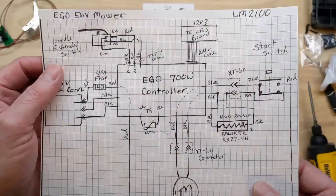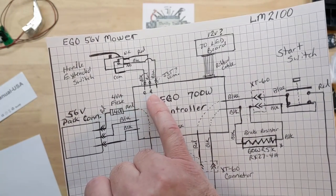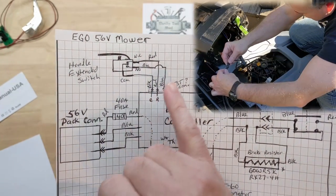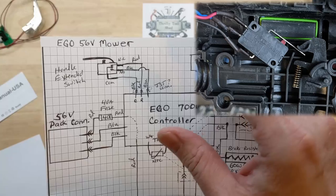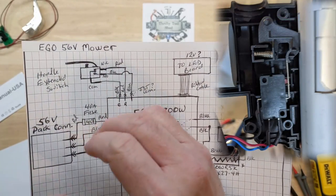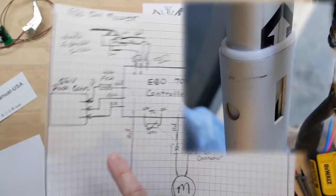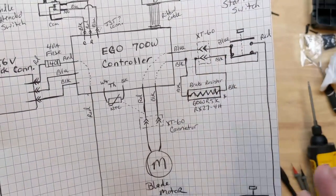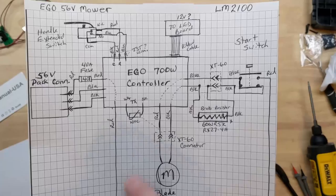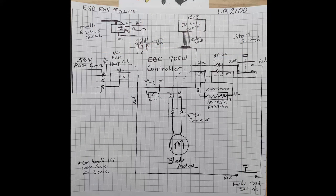When the button is released, the black goes across this 60-watt 0.5-ohm braking resistor — and notably these resistors can handle up to 10 times their rated power for five seconds — so when you release it, the motor energy is quenched across this resistor, which is why the motor stops so fast with the brake connected. I've also drawn in the NTC thermistor, a small white-and-black wire tied to the red wire. The ribbon cable goes up to the LED board — I verified the LEDs themselves are good with 12 volts. The handle extend switch uses black as common, blue as normally open, and red as normally closed; when the handle extends and the cam falls into the groove, red is made back, which is why you can sometimes jump black and red to bypass that switch. Getting to the controller to repair it with that hard epoxy potting is nearly impossible.